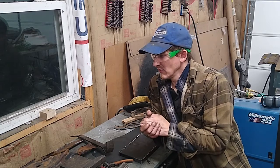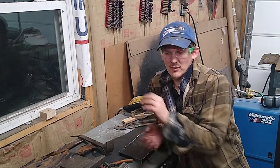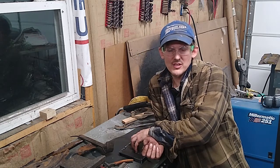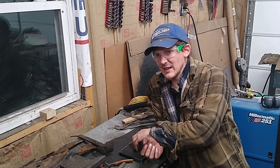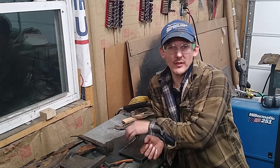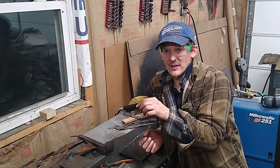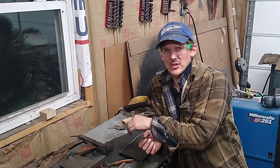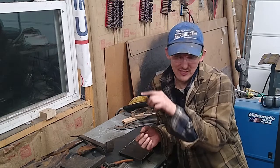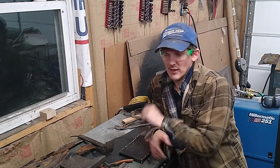MIG like TIG violates some of those rules such that you're welding the metal — like this is an eighth inch plate — but if you use a certain technique, you weld it like it were a sixteenth inch plate or something thinner than what it actually is. That puts in a lot less material, you get a lot less penetration, but because there's so less material you have time to make these swirls that make it look fancy and nice.